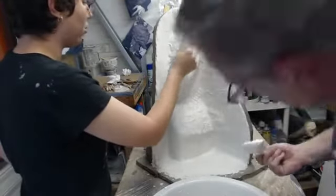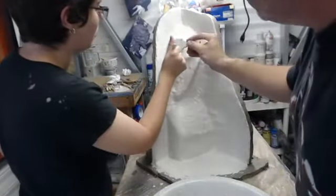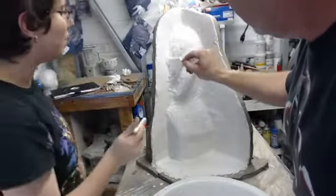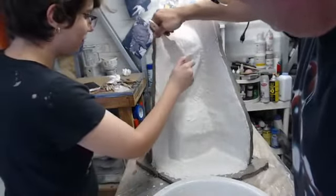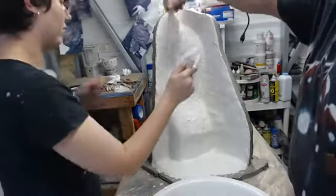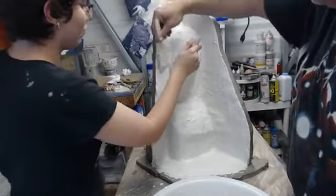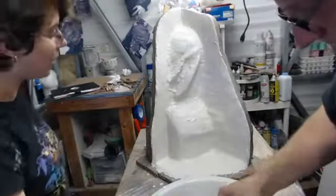It's essentially the scumbling technique in painting, but with plaster. Yes. Let's see if we can trowel this in here. Gypsum based, sort of concrete. Oh, yeah. There's something oddly satisfying when it gets to actually do what you want it to do. We're getting a little lip under here now. Yep.